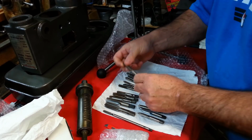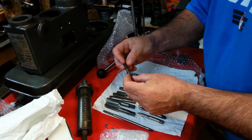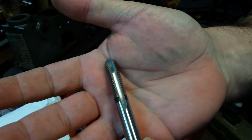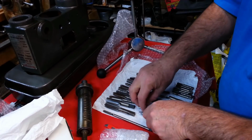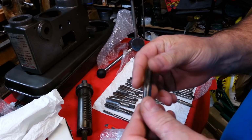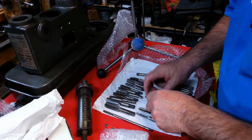Unknown brand. I'd have to look at it under magnification. Another Butterfield. 7/16, 14. Butterfield. Earlier Butterfield. 5/16. This is a gun tap. Pushes the chip forward. And hopefully I don't already have a gun tap in this size. Doubting chrome clad. This looks like possibly, that's pretty sharp. I don't know. It's just an older one. Can't read that, but that looks like 3/8, 16.